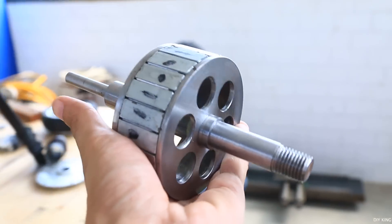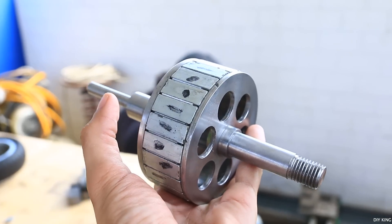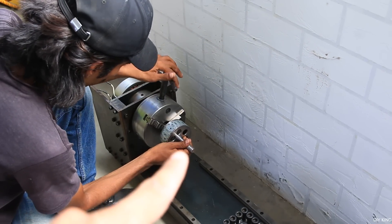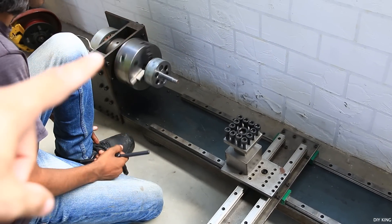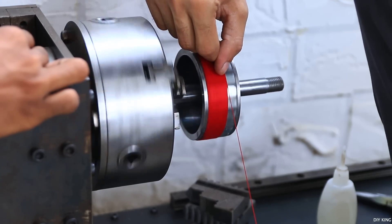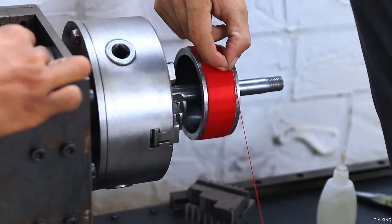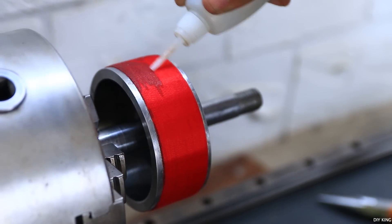We managed to get all the magnets in place on the rotor. Before we spin it inside the alternator, we need to secure all these magnets so they won't fly off at 4000 RPM. For that we are going to use thread wound over the magnets on our DIY lathe — stay tuned for that project as well. We applied two layers of thread, later strengthened by super glue. The right material here would have been carbon fiber, but for the time being we were unable to get that, so fingers crossed.